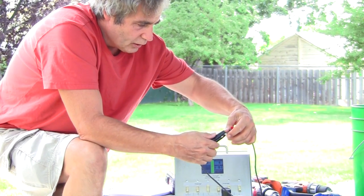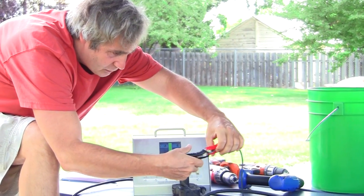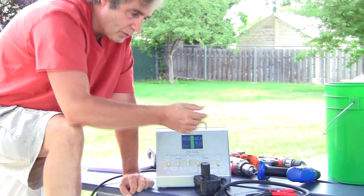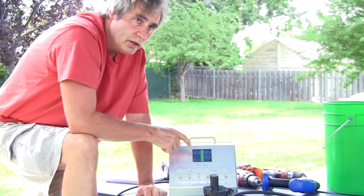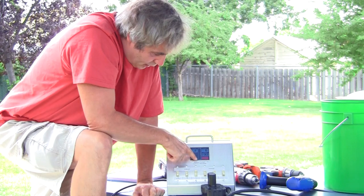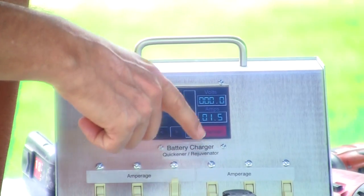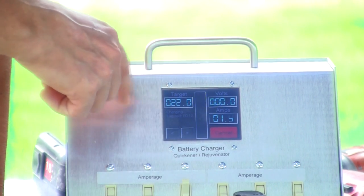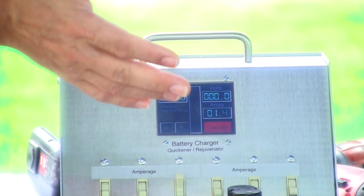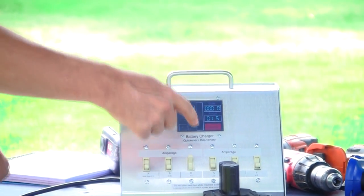Now we're going to clip the leads together — I'll show you that this thing can be short-circuited and still works just fine. We're going to short-circuit it right now. This is what happens when you're charging a really heavy capacitor — like a multi-farad super capacitor. We've got the same settings, hit Start. It says zero volts, and there's nothing on the percentage, but it's showing 1.5 amps coming out. Target is still 22 — so that'll charge up a capacitor. You can leave it like that all day long, it doesn't hurt a thing. It's current-limited and the voltage depends on the load. You can't do that with any other charger. Hit Stop, Cancel.